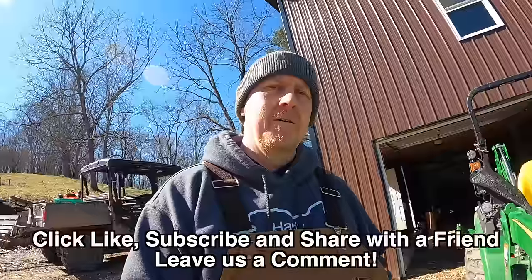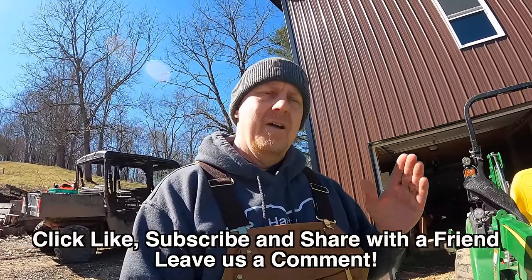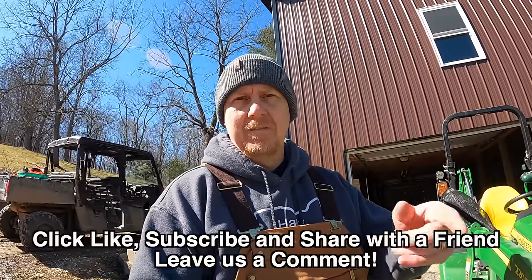Pretty cool feature. I hope you found this useful. I just want to remind everyone to keep those loads low and slow — keep them low to the ground and travel slow. The front end loader can be one of the most dangerous attachments in terms of rollovers and tip-overs. We've got some video Jason's done on the smaller frame tractor, the 1025R, about that. Use ballast. Thank you so much, hope you have a great day — hit that like and subscribe, leave us a comment, tell your friends about it. We'll talk to you soon.